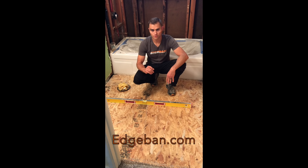It's important when you're doing this that you choose the right product. There's a lot of different types of self-leveling underlayments on the market now, and some are designed specifically for concrete or a concrete overlay. But if you choose the right product and you prep the floor correctly, you can pour self-leveling underlayment over a wood subfloor.